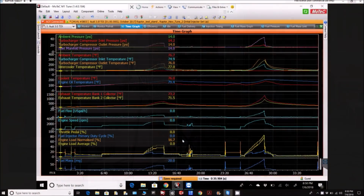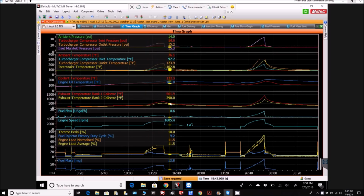So if you're still hanging in there, still watching this video, let's go over the numbers. There's probably a bunch of people got bored by now and they clicked off, but anyway, for the rest of you guys who dig this stuff, here's the numbers. So there's the first run there that I did. As you can see, got it up over 3000 RPM there, only burning just over 5 gallons an hour. So it doesn't burn very much at the low power settings there, which is really neat.